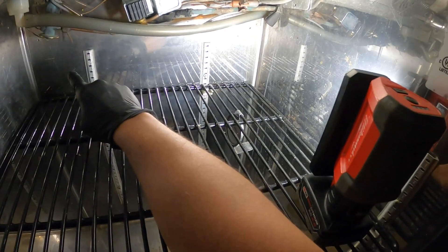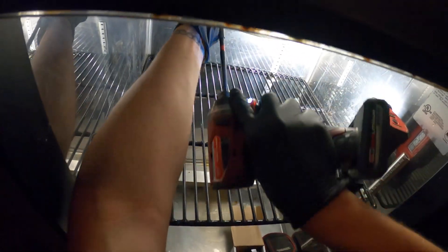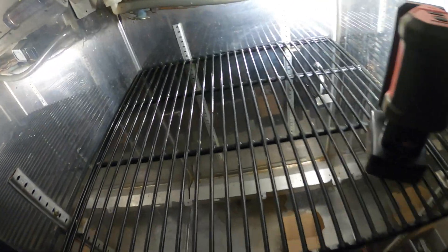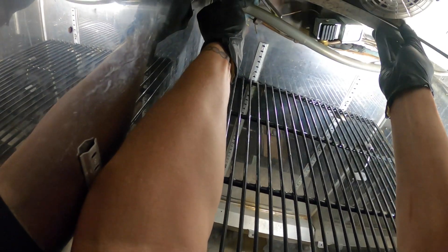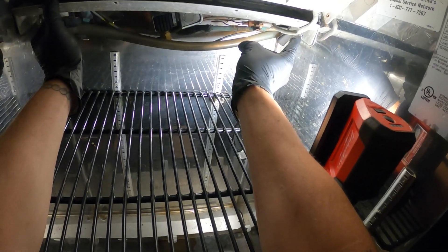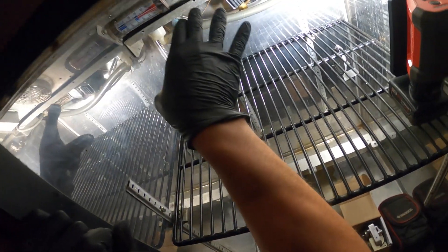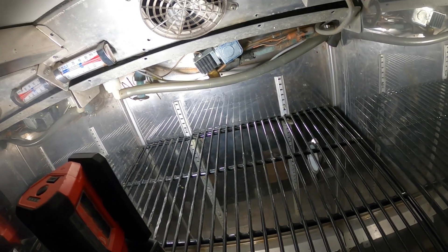There's an expansion valve and we're going to have to try to get in here somehow. We'll need to take out this drain actually. This here is the condensate pan — let's take that out if we even can. It might just drop down slightly because all this is in our way: the electrical. This panel probably has to come down; there are 5/16 screws on the sides, and that should be able to drop.